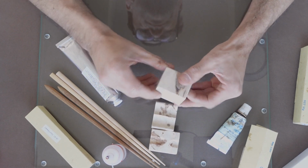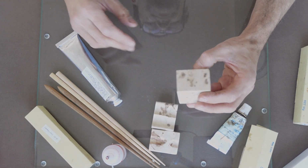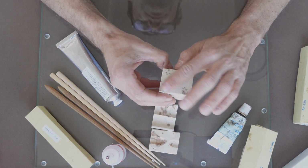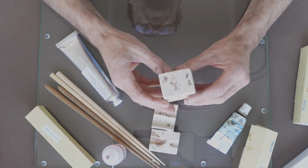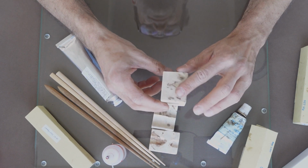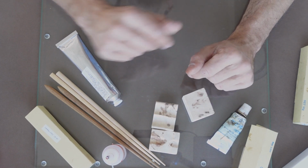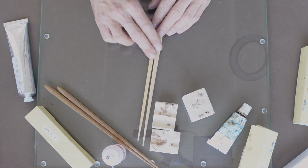And how I prepared the wood. As I said, I was not very thorough with sanding, so I just used some sandpaper up to 320. But as I said, burl is very uneven and I want to fill it with sabi anyway, probably, or sabi mixed with a pigment or something else. But first I want to see the areas with imperfections, so I will start with just diluted urushi and then we will see it. But the chopsticks were prepared much better, especially those.